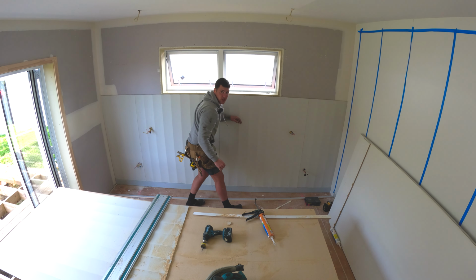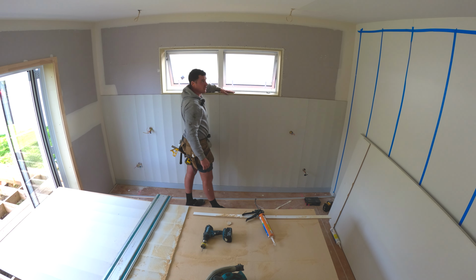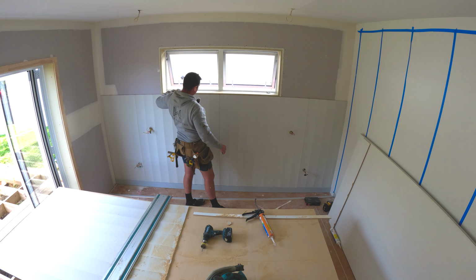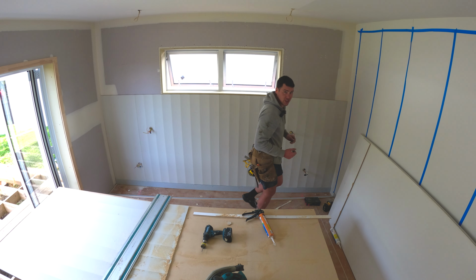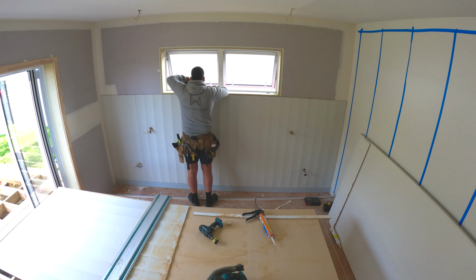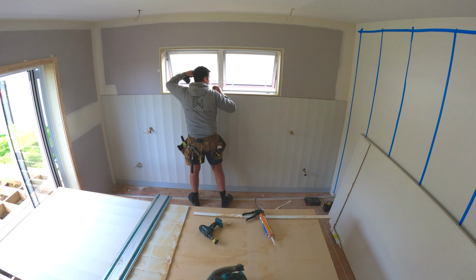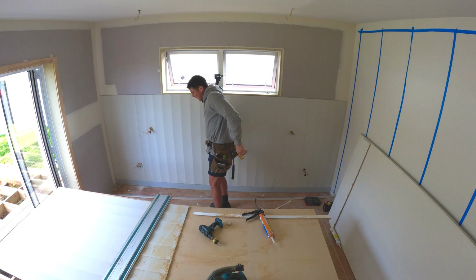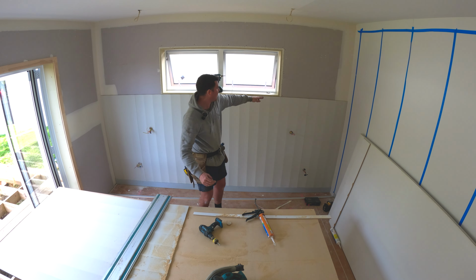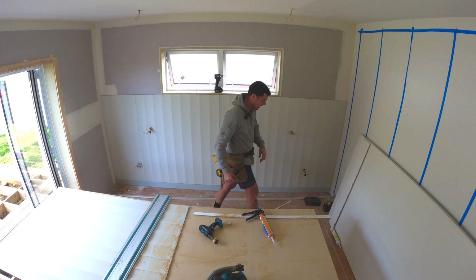What's happened is the person that screwed this window off, so all the joinery got installed by another person. There's actually a big dip in through here, so I'm just going to undo that screw, put a wedge in and get it nice. I was going, what the hell, that can't be right, because both ends are good, but the middle's not.